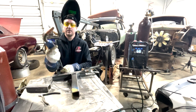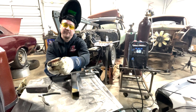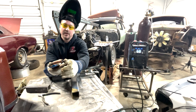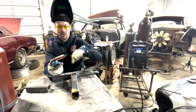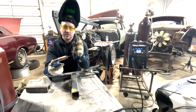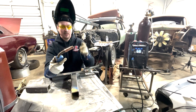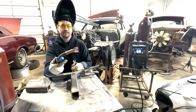Another important tip: look closely at the feed wire on the torch. After welding you'll see a burnt-back area at the tip — that metal has already been heated. Take your wire snippers and cut that off so you don't have to re-melt it when starting on new material. Almost every time I start welding a new line, I snip off the old wire end. Even if you're using a basic wire welder, if you put your ground closer and snip the wire back before you start, your welds will happen quicker and more efficiently.